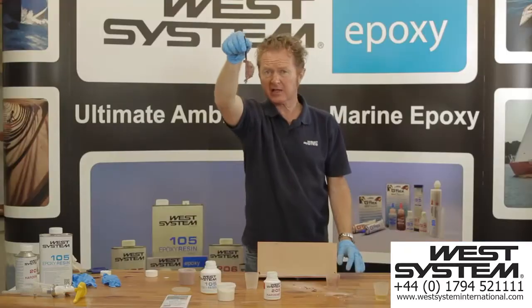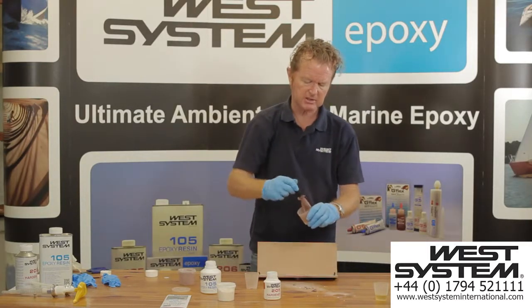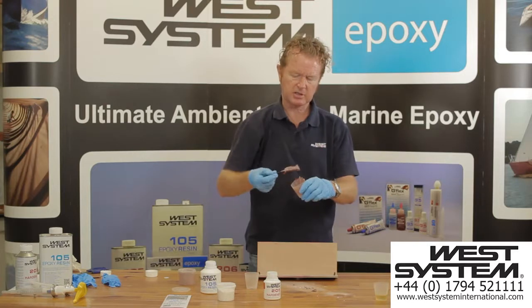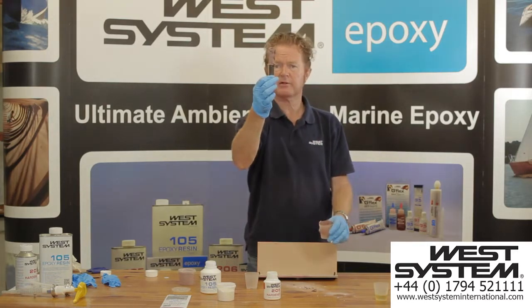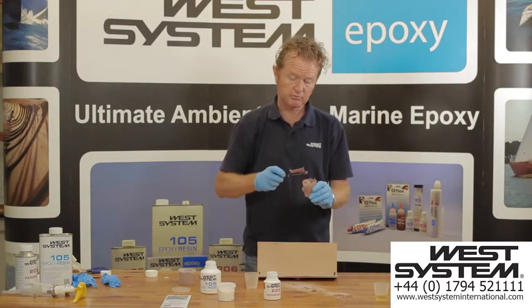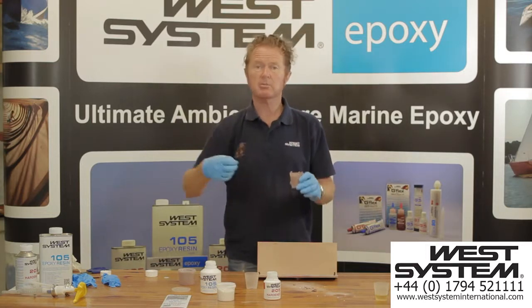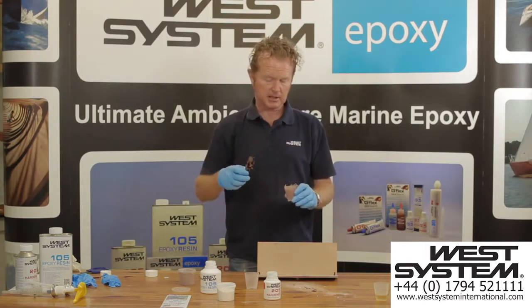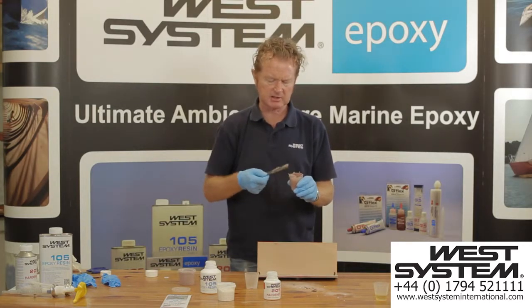You can see how this hangs on the mixing stick and doesn't fall off, and it creates nice peaks that don't slump. Very important, because we don't want our fillet to slump into an odd shape. Fillets are really very much part of the aesthetic of a modern wood, plywood, epoxy construction. So it's very important to keep them nice and neat.